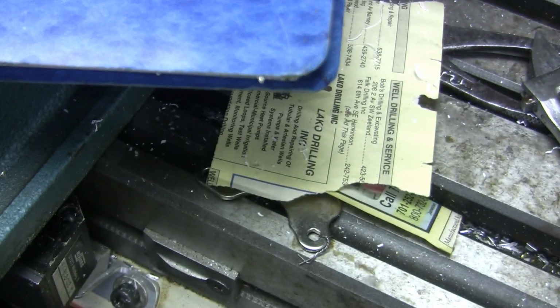So anyway, that's basically doing my NC lathe work on my mill. The next step for these will be to go over in the lathe and poke the hole through it with my high-speed attachment. So when I come back, I'm going to make a bunch of these, and then when I come back and start drilling that hole, I'll show you that setup also.